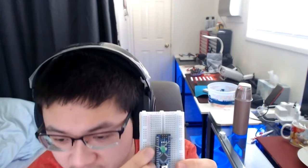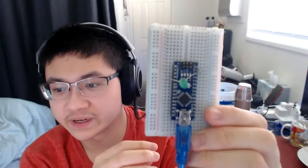I have an LED with a 330-ohm resistor soldered to the end of it — just to protect it from over-current or over-voltage. I've plugged it into the D2 pin of the Arduino, because these are the GPIO pins. One end goes into a digital pin and the other end goes to ground. The pins are usually labeled on the Arduino so you can know what they are. On the Nano, it's D2 through D9.